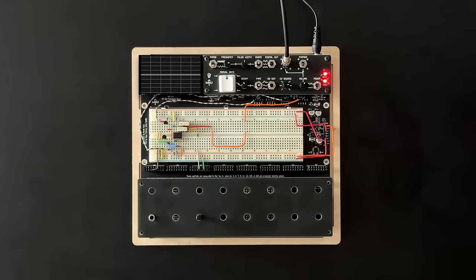As expected, we get a short blip every time I push the button, and we can tune it using the potentiometer. Also, we can vary the output volume via the accent CV input. Great! Depending on your use case, you might want to extend the decay of this a little, though.